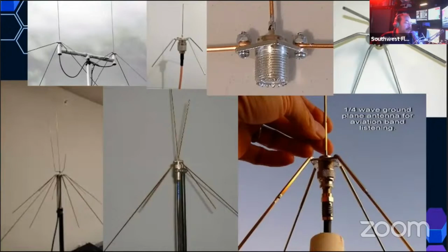If you wanted to just think, okay, what's the easiest one to build? Go to Home Depot, buy 5 or 6 feet of copper wire. The guy will pull it off the roll for you. It'll cost next to nothing. And get this little UHF plug from Amazon for $3. And there's your first antenna. And buy a box of little bolts that'll fit through those holes, so you've got the nut and the bolt that fits through the hole. And then you're down to just soldering the middle piece on.